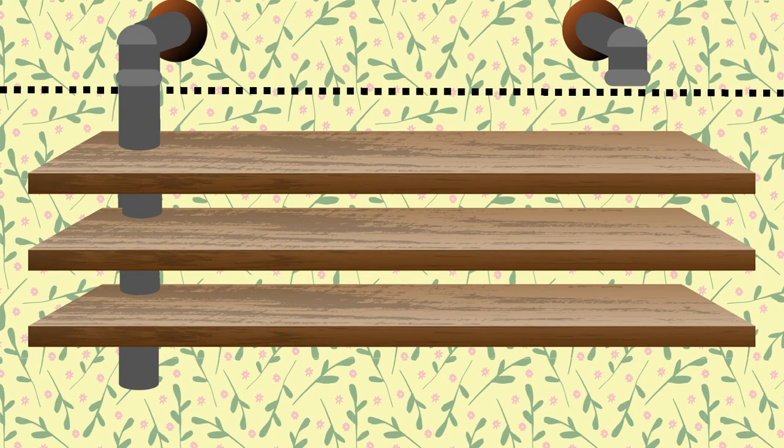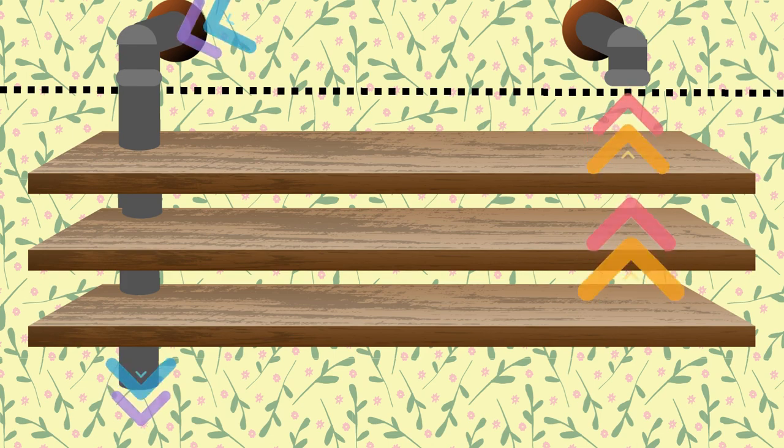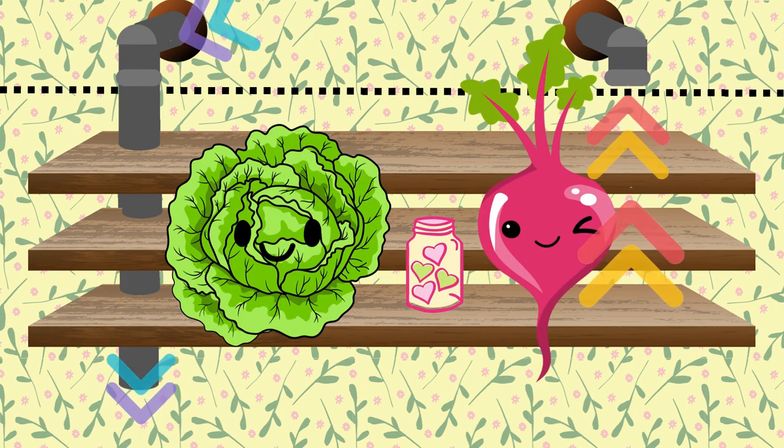So what we're going to do is drill a couple of holes and put in two vents. One of the vents will allow the warmest air inside the cold room — the air that's up high — to get out, and the other vent will allow the cool air from outside to come in to the bottom of the cold room to help push that warm air out the top.